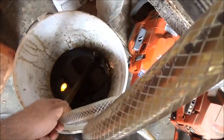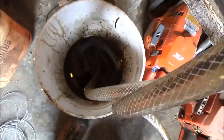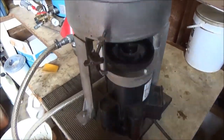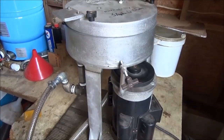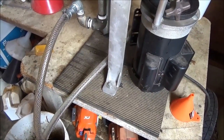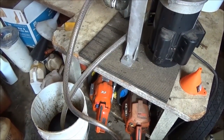Alright, we're coming to the end of the run. The centrifuge is working just like it's supposed to. This is the dirty bucket. The heat trap is working good because on the good side it's coming on time, and there's a vacuum being pulled through the storage line — that was causing the bubbles in there. We're about ready to stop; I'm going to pull the plug. Let it wind down, and once you hit a certain speed the oil inside the centrifuge wall will start to collapse and the fluid will come out the drain hole. The drain hole is right there in the center of the centrifuge down inside, so it has to stop spinning before it can drain.